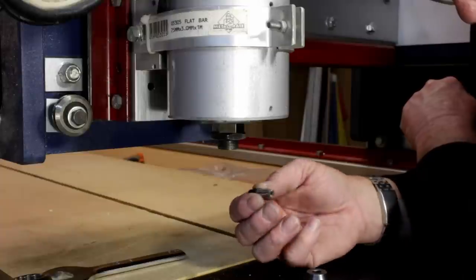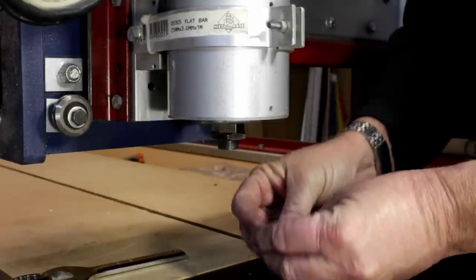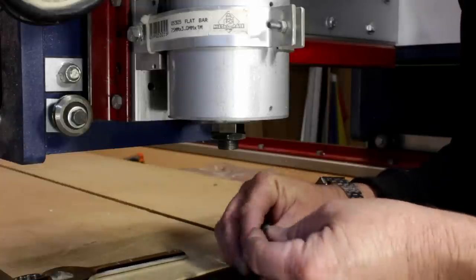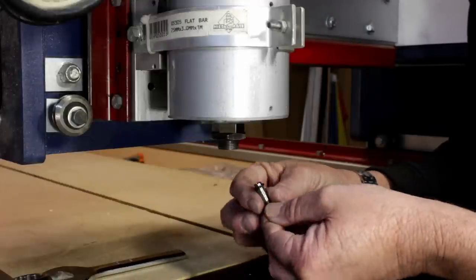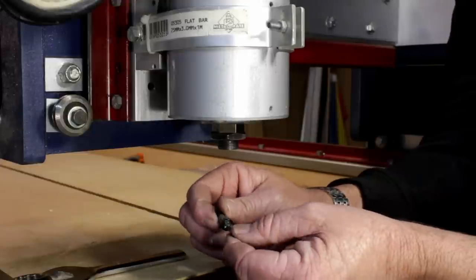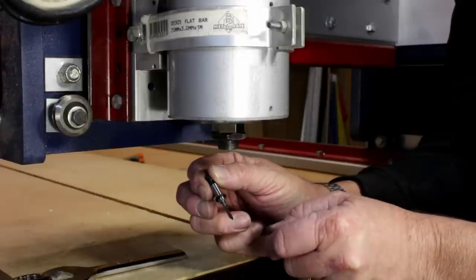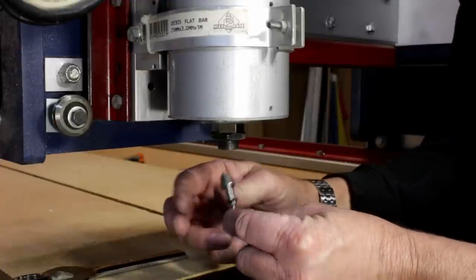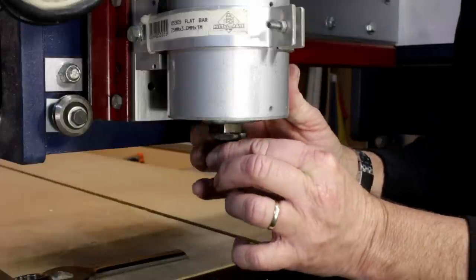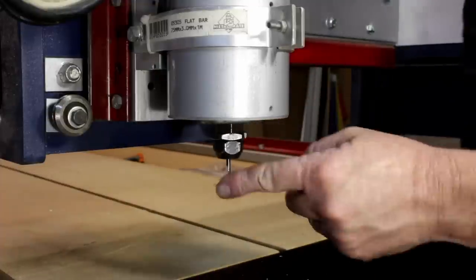But while researching this video I've come up with a way of making this really easy. I'm going to take our little O-ring and slip it onto the collet adapter, bringing it down so we've got just enough sticking out — about an eighth from the bottom of it. This does two things: first, the cutter will slide in and stick firmly wherever you put it, because the O-ring closes up the gaps in the collet adapter so it doesn't fall out. Second, it allows us to put the collet on top and drop it into the collet nut, because the O-ring stops it from falling through. I can now tighten up my collet and everything's set exactly where I want it.